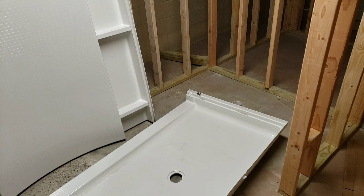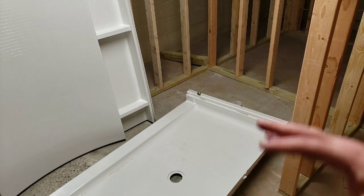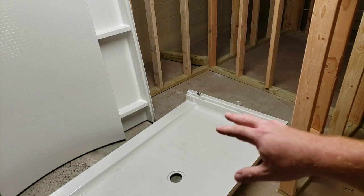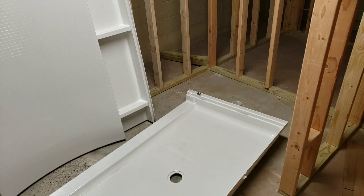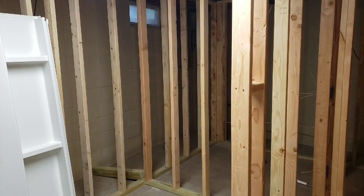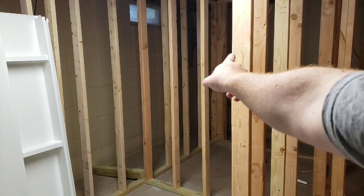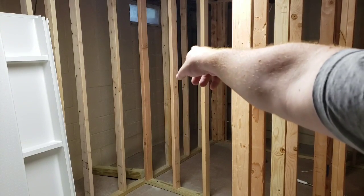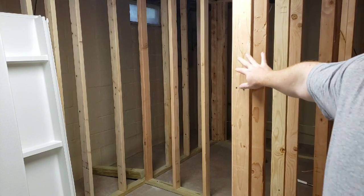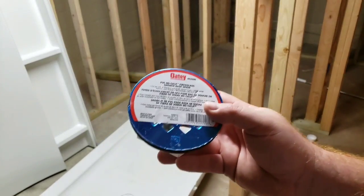This is going to go down here. You can see I have a fiberglass base - this is actually the Sterling, it's a three-piece shower kit with the base, making four pieces. I've been finishing my basement so I have my walls studded out. When you're doing a shower base there are certain parameters you want to follow: the back studs are 15 inches off center, and 16 on the ends. Make sure you have the right base size. I have another video on my channel covering the full installation.